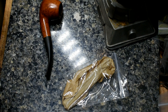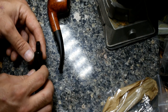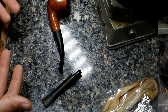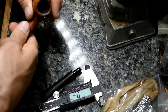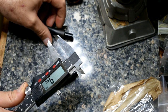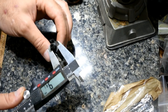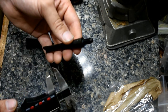I also have the stem from Garbage Man Piper's 1025 Savinelli that he had me restore, and I'm going to show you guys something very important to look for. Not all Savinelli stems are drilled the same way. If you take a caliper and measure this stem from a Savinelli 626, you get an OD measurement of 10.02 millimeters. But if you take this other very common Savinelli stem and measure it, you're looking at 8.01 millimeters — so this one obviously cannot be modified in this way.